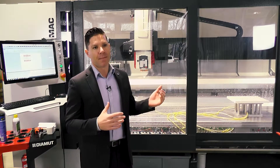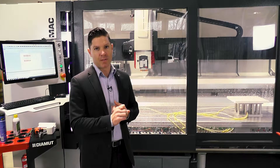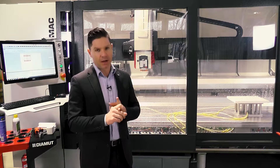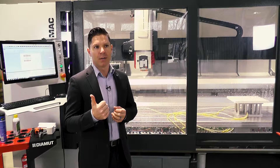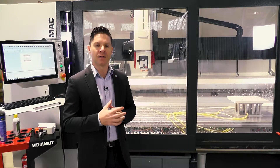We're going to get started on creating that footprint and running these tools on the machine. We'll start off with the Super Z. I went ahead and watered down the table — putting water on the table helps with suction, so if you have any leaks or issues that creates a much stronger vacuum. The Super Z is going to trim that one millimeter off the material. Then we'll take our first through fifth position diamonds, which we can run fairly fast. When we get into the polish wheels we'll have to slow things down and verify heights and diameters.